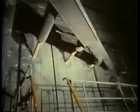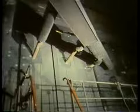Casing penetrations are the places where pipes or tubes go through the boiler casing. These are weak areas of the boiler, and failures can start here. Also, thermal expansion may press the pipe running through the boiler casing against the casing itself. This can damage the casing and the pipe. A hole in the casing can lead to corrosion.